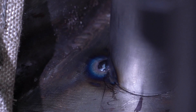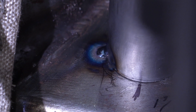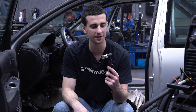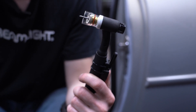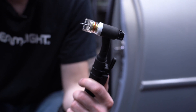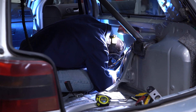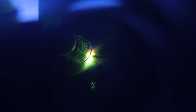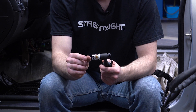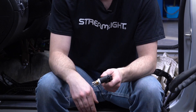Our next step is to fully weld in all four points of the cage so we can continue on to the diagonals. This is our standard WP17F flex head TIG torch, which ships with all our TIG welders. We have a short back cap on here because you get into a lot of tight spots when welding a cage like this. Something else that's really helpful for visibility is a clear gas cup — we sell Furick cups and our own Eastwood clear Pyrex lens glass kits. As long as you keep a close tungsten offset, you can be pretty flexible with your torch angle off perpendicular from your weld joint.